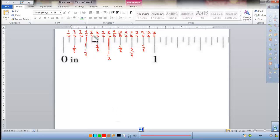Today, as we're measuring, we are going to measure everything to the nearest 16th. So if something came right here, we would have 11/16 of an inch. We're going everything to the nearest 16th, so to the nearest little line that it's at. And then make sure if you said, oh, it's at the 12/16 mark, that you simplify that to 3/4. So on that top ruler, there's an arrow pointing, and you can see it's at this line right here, and so it would be 1/2 inch.